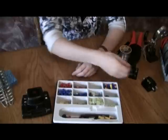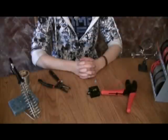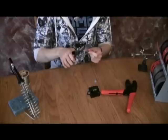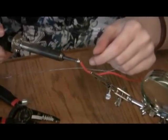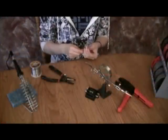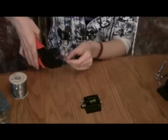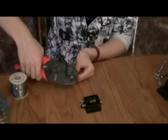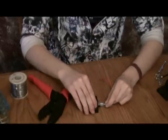We use the female connectors to attach our spikes. We have pre-cut the right gauge wire for our connector and are going to strip the insulation from it. She is going to tin the wire in order to improve the connection when she puts it through the connector. Now we will take the wire, push the soldered end through the connector, then line up the crimping tool and the connector and squeeze tight. This will complete the connection and she can just push it onto the spike.